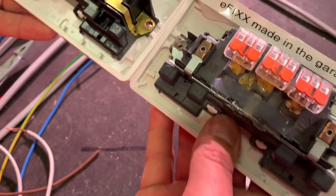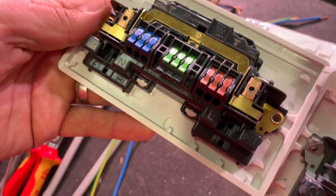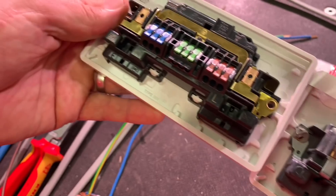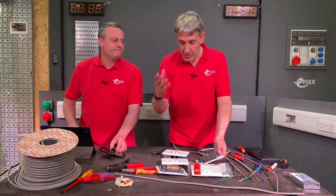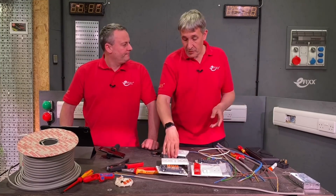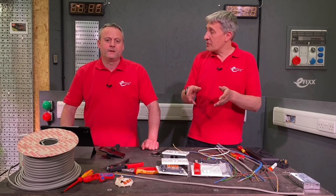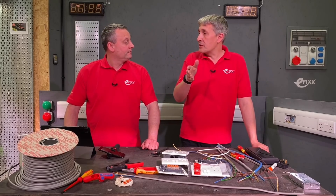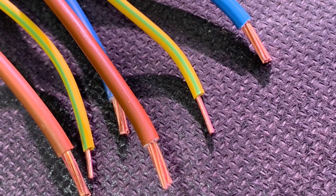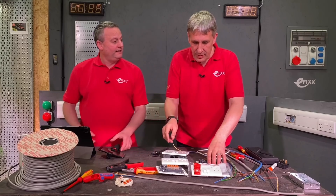It's amazingly similar. So we've got three levers for each of our conductors there. Is there any rules about what those levers need to be able to take? There's a lot. Let's start with conductor size. To be a 13 amp socket, all sockets need to be able to take three 2.5 millimetre conductors or 1.5 - you're probably thinking back to mineral insulated - or perhaps more common now, two 4 millimetre conductors, thinking of those large radial circuits for a kitchen.